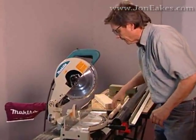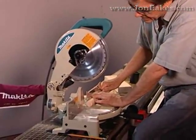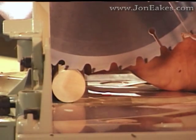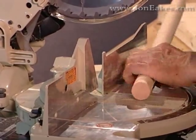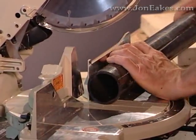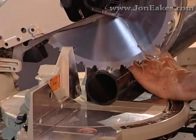A couple of complications come if I try to cut a round material, like cutting into a dowel. The reason is as the teeth come down, they actually want to cause it to turn around, and that can cause it to take a larger bite than it should. You'll see this mostly when you use something like ABS drain pipe — this stuff can actually explode in the saw if you don't do it right.